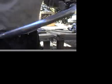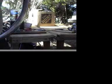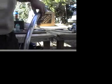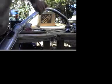Look at there. It's just pretty. I got a lot of pitting on this one, and I'm not taking that all the way through. I'll fill that in with silver solder later on. I got a torch, I got a stick of silver solder, I know how to polish that out and make it look like chrome. All the rest of this is going to come out real nice.